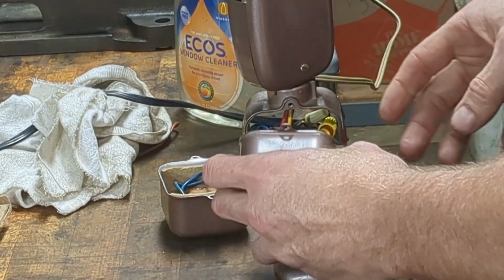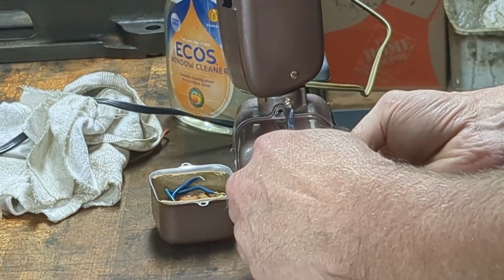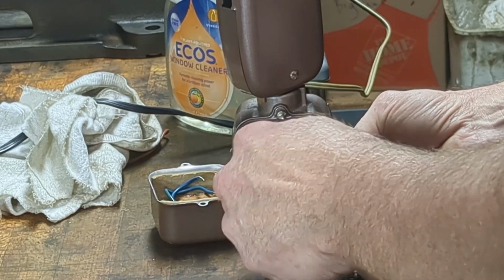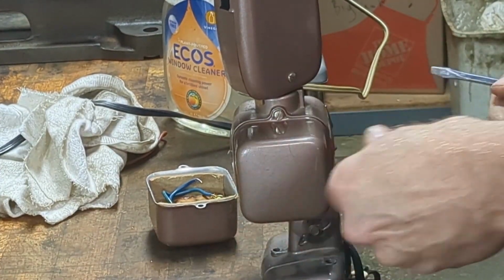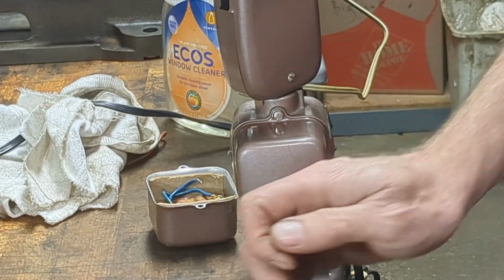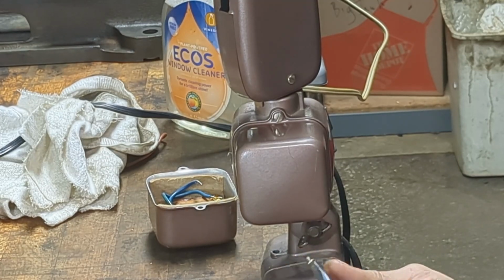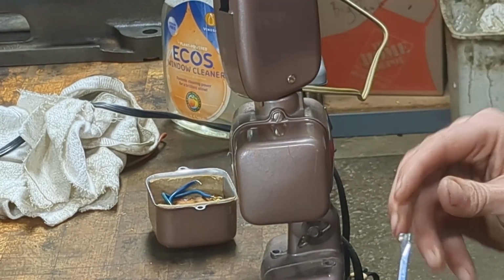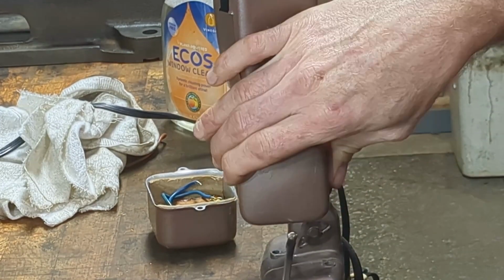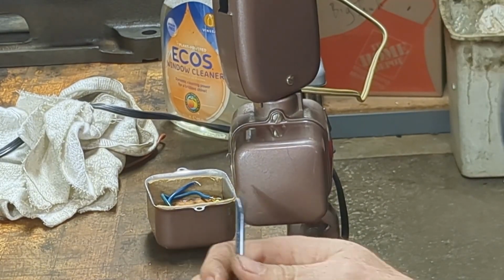And you don't want to tighten it all the way the first time. You just want to make sure that the second screw can slip into its hole as well before you tighten up the other one completely. If it is out of line and the first one is tightened up all the way, then you may not be able to get things lined up on the other side.